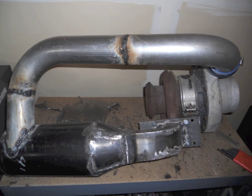Here's the second 90-degree bend that we cut. What you're going to want to do is take it and fit it in between the other pipes that you cut earlier. You'll probably need to do a lot of sizing, cutting, and resizing. So just take your time, be patient with it, and then weld it in place when you're done.